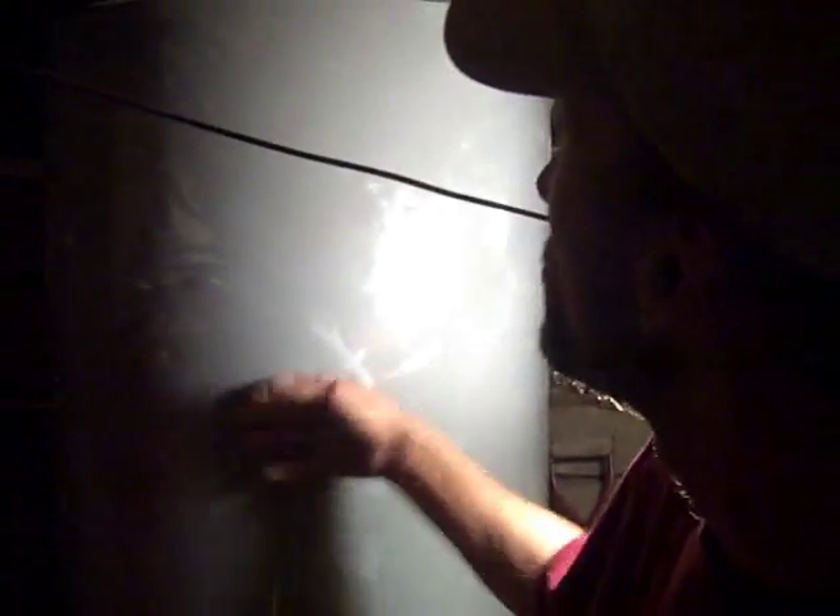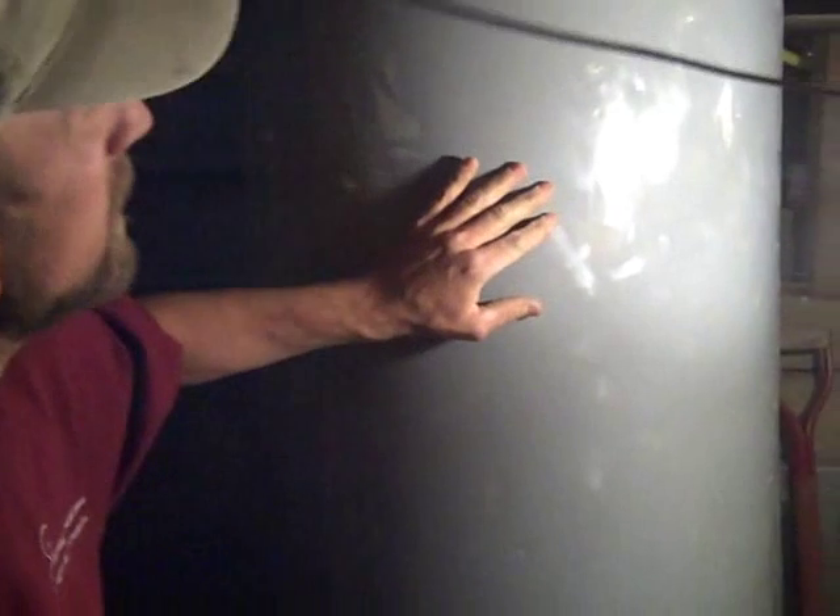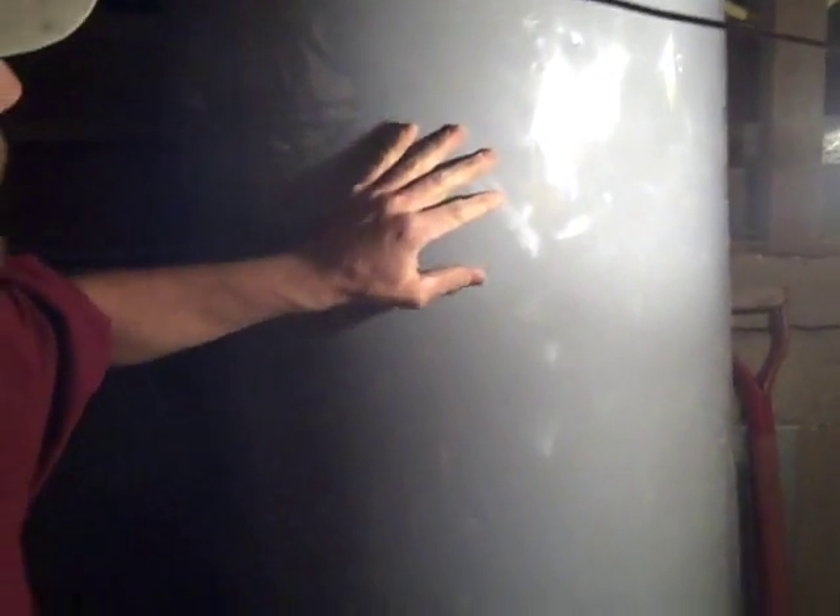We have a little height issue, so we have to dig down into the floor there — jackhammer it out. Well, a sledgehammer. But we're going to kill two birds with one stone: we're going to dig down and create a French drain for them as well, because there's no drainage in this basement. With this tank having 80 gallons, we want to have somewhere for water to go if anything happens. That's a bonus — two birds with one stone.